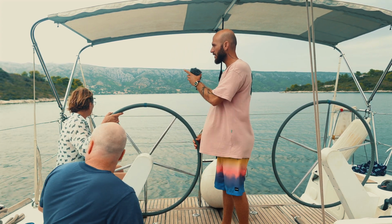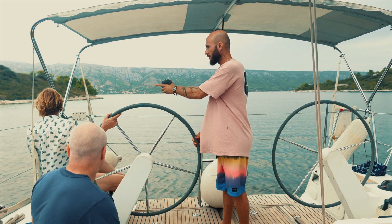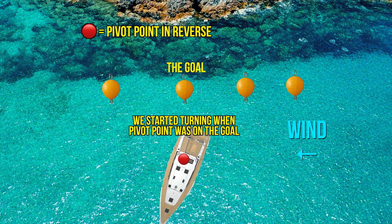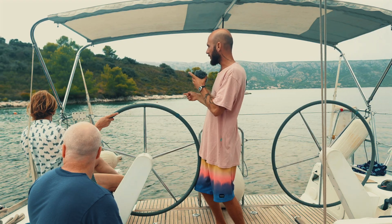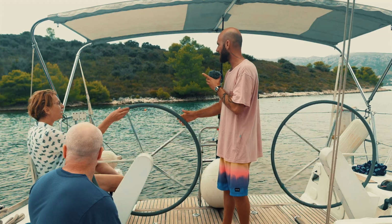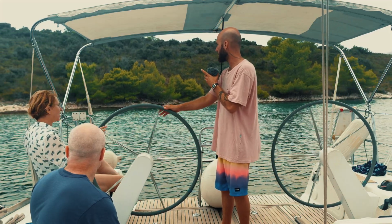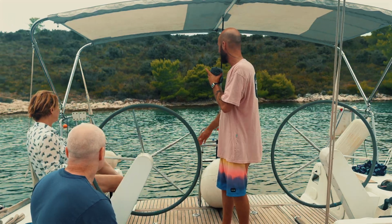And now look, you see that they passed you? We're almost about to pass it. Just keep how you're looking. Right. Now if you break the helm all the way, look what happens to our trajectory. You see how we're staying on them? Now we're turning. Remember that we need to counter steer at some point? Now start to counter steer. That's the middle. Let's keep it like that. We need a little bit more steerage, we didn't need to counter steer too much. We're turning, and now counter steer. And now keep it straight.